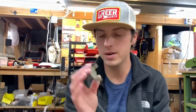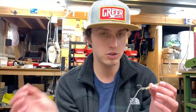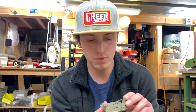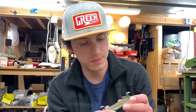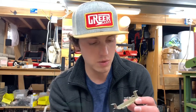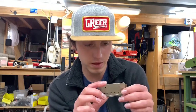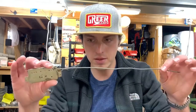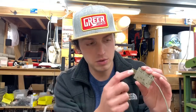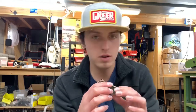These are hard to come by by themselves — you really don't see this very often. It's unusual to see just the individual parts; usually it's a whole pickup. But it's actually in pretty decent shape. Most of the decal's gone, but there's enough of it there to know what it is. Blacklight's real good, we got our tooling marks. Somebody put a little solder right here — that wouldn't have been original, but that's not a big deal. Got a nice length original lead, and the mounting screw holes aren't reamed out or anything. Looking promising.